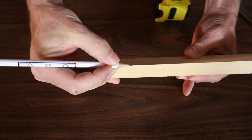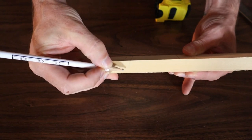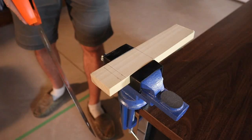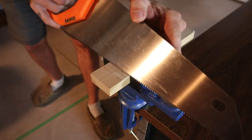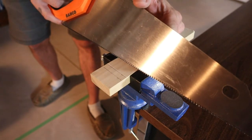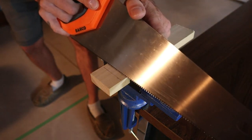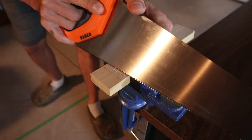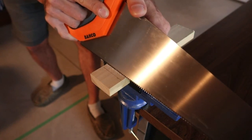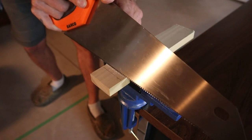You're going to make the notch just about a sixteenth of an inch longer than the thickness of your phone. This phone is about five sixteenths of an inch, so I'm going to make my notch about three eighths of an inch thick. You're going to want to make the notch on about a ten degree angle and go about three quarters of the way down. You can kind of just draw this by hand to guide your saw. Clamp your piece of wood in a vise as close as you can so it vibrates and bounces around a lot less.